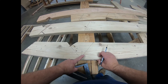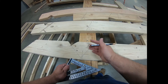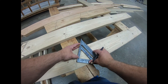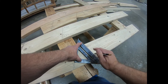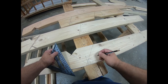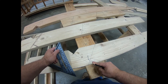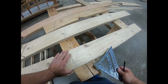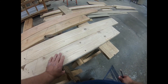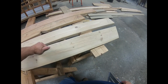You don't want this point over here sticking past the end of the stud, so if you're using a two-by-four, this distance from here to here should not exceed three and a half inches. You have to play with it to see how high up you can go. Once I've decided the depth of my bird's mouth, I'm going to make a perpendicular line — that section would get notched out — and then you leave whatever tail you have left on the bottom. That's how you lay out a common rafter.